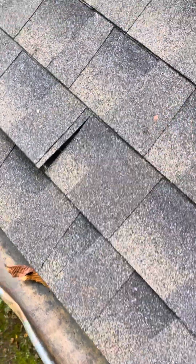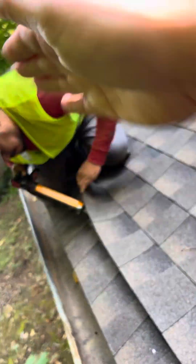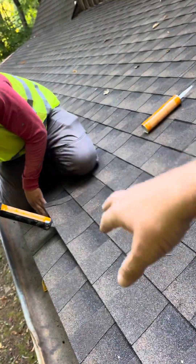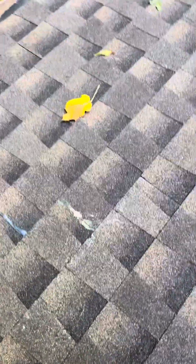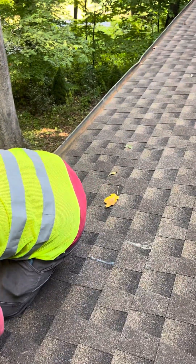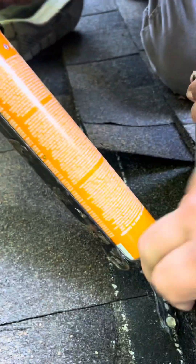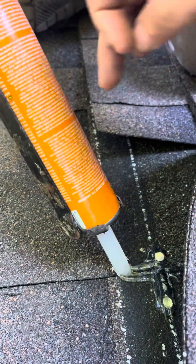So we're sealing every one of these. Juan, I want you to look at both sides — do you understand? Make sure that there's nothing on the other side: no nail, no nothing, so look on the right and the left. We're actually putting an extra layer of protection beneath the shingles, not on top. I want this silicone off this roof, Juan. Pull up a piece of this silicone, take it down just a little further right there — cover this as well. I don't want any possible way it can move over towards that gap.